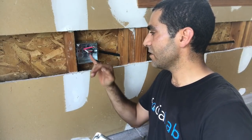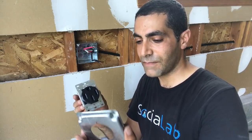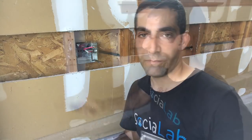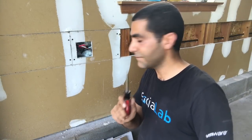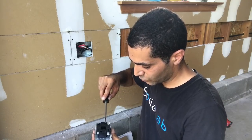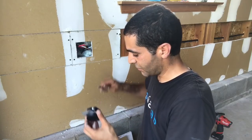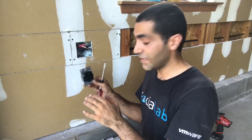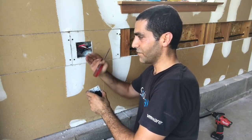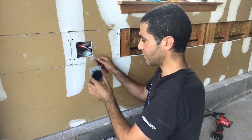Our leads are all cut to length with the ends stripped off. We're going to put a couple pieces of sheetrock back on the wall because the NEMA 14-50 receptacle is going to mount with the cover plate on top of the wall, flush with the wall. All the holes in the back of the receptacle are marked - white is your neutral, ground is marked ground, and X and Y are your hot red and black. You can put them in either one. Just make sure the ground is up, because Tesla requires that the ground be up due to the direction their mobile adapter hooks up - it puts some weight in one direction and with the ground up the wire will always go straight down.